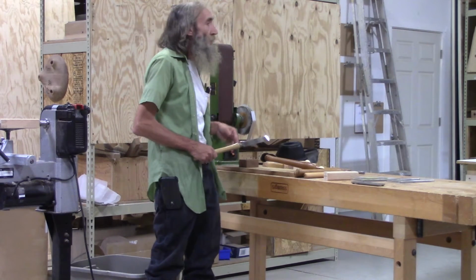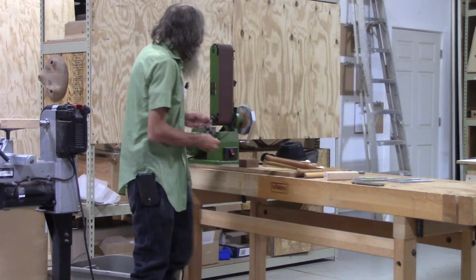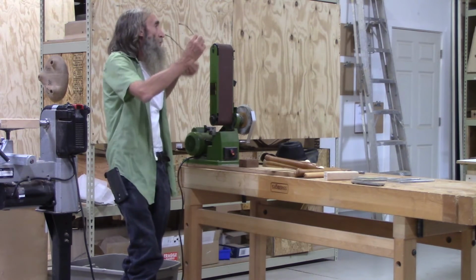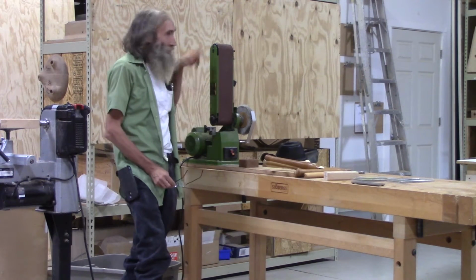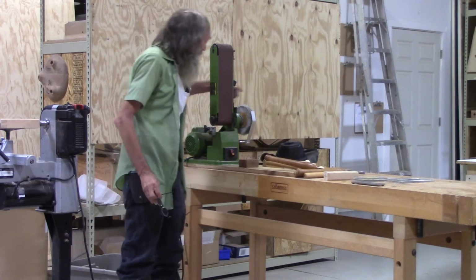The only difference between that as it comes out of the factory and the way we did it is you take the belt off, go down to the hardware store, buy one that's 1 inch longer, turn it into a figure 8, give it a half twist, and put it back on. And the hooks, reverse it. That's the only modification I made to it.